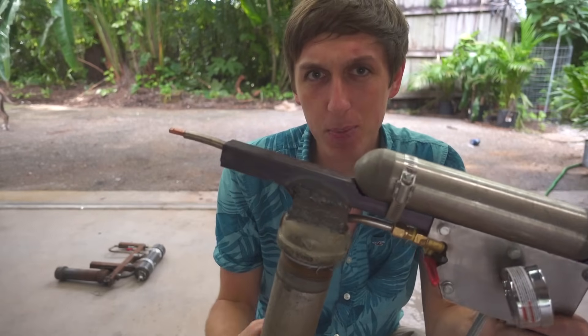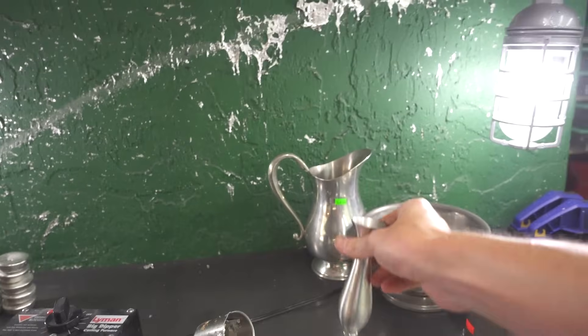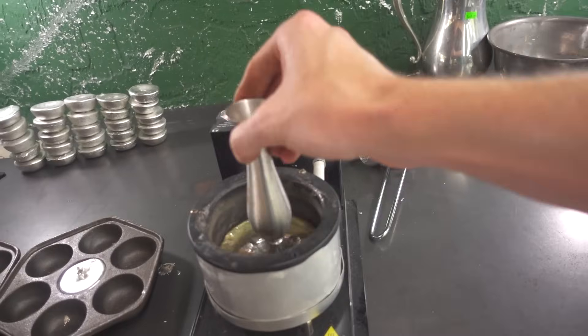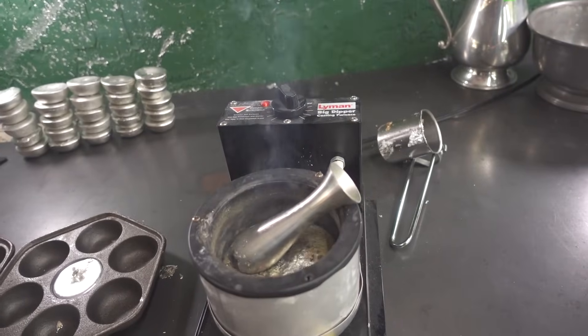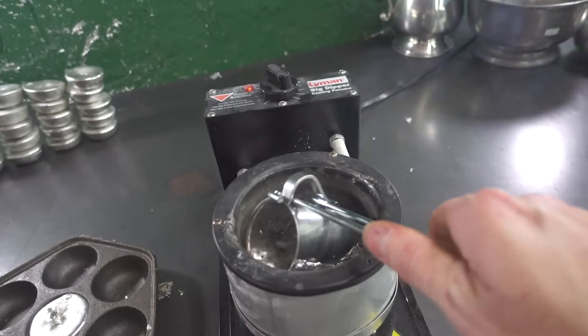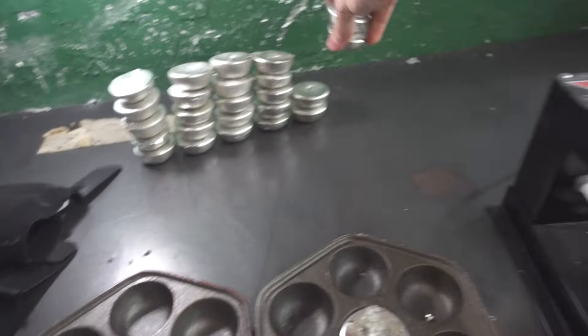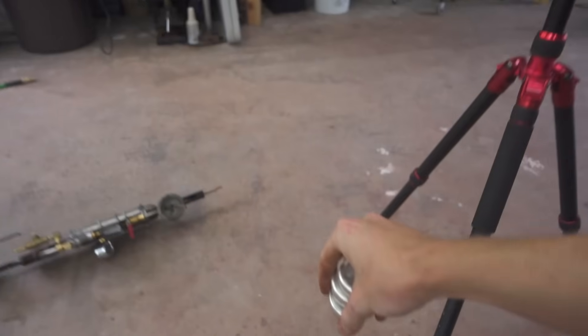This is full of molten metal — it forces the molten metal out of the tube into a nice cool stream, hopefully. I need to keep this airtight, so I need to use Teflon tape on the pipe threads. But the problem is Teflon melts or decomposes at around 400 to 500 degrees Fahrenheit, which limits the metals I can use. So we're going to be using pewter today. I went to Goodwill and got this vintage pewter — we're gonna melt it down and pour it into a mold to fill the gun with.